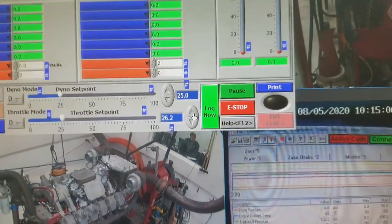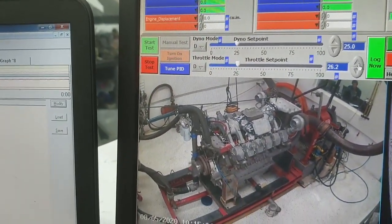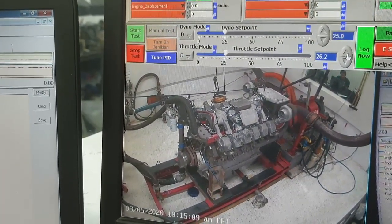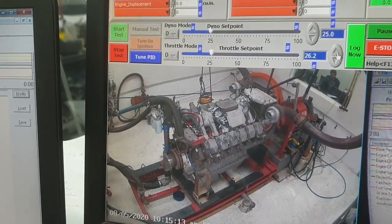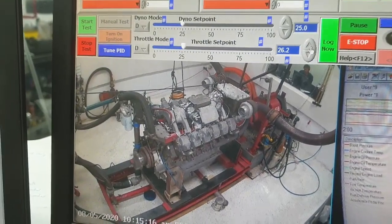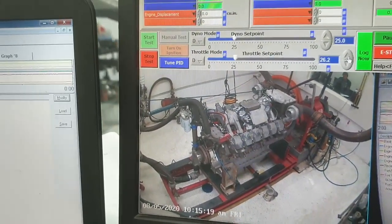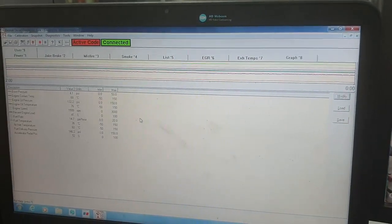I haven't had much to do with the MTU German system. You can have it two ways with these engines: you can either have the MTU electronics, the German one, which used to run just one ECM, or you had these ones which run the Master and the Slave — the old American ones. It is a biased opinion, but I do think that the DDEC3 system is a far better system than the MTU electronics.